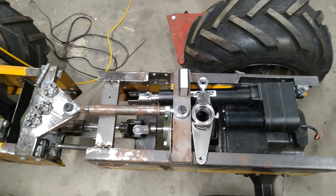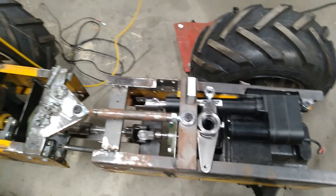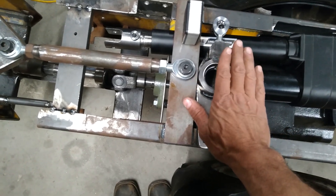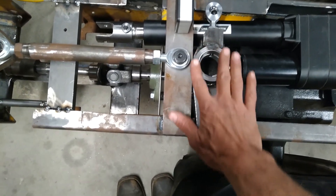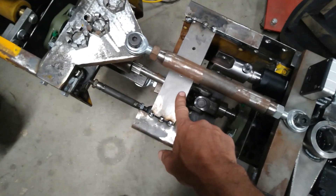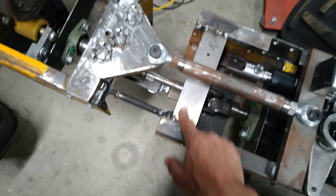If the push rod's sitting here, I'll get a sprocket that's less than nine inches. You can vary the chain size — if you want 40 teeth and a nine-inch versus a twelve-inch diameter, you just get a chain with narrower links. I'm going to machine the inside of it out, preferably press it on here, make sure it's as square as I can get it with the bottom of this piece, and then weld it on. I'll probably make a new cross link piece — maybe four inches wide instead of the current two inches.